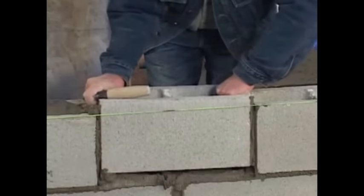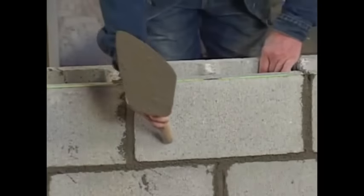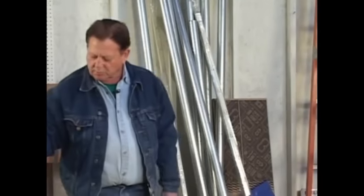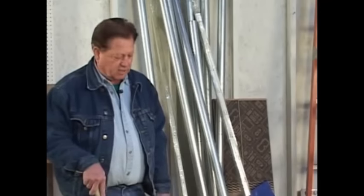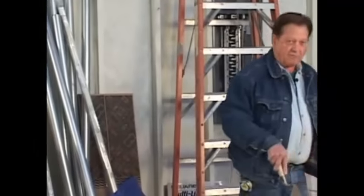In she goes. The enclosure. For every enclosure, usually you have to add a little bit of mortar in that joint. When you're building a wall, it doesn't really matter whether it's 5-6 feet or it's 20 feet. You always start with a bar of steel on one end. That's the first web. And then you go one bar of steel every other web. So every other block, like every block. And you always have one on the end.